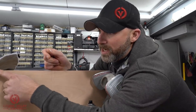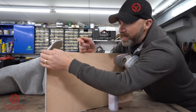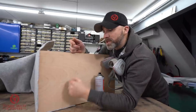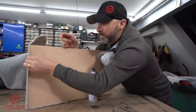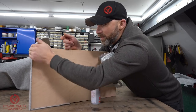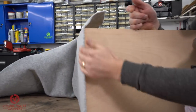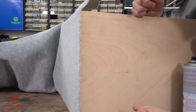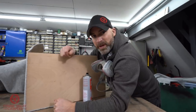As I've already explained, we're going to start our join on this edge — which is why I made sure there was lots of adhesive on that edge. I've left a small overhang because I want to use my fresh blade to make sure it has a really nice flush cut before we then glue up to it. I'm pressing down nice and hard so I know there's a full area of contact and the glue has really set in. I'm now going to flip the box on its side and repeat the same for all four sides.